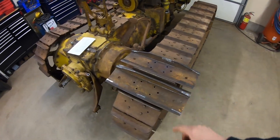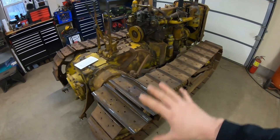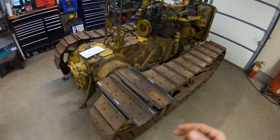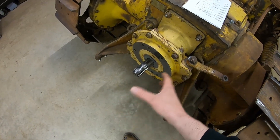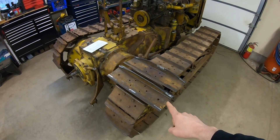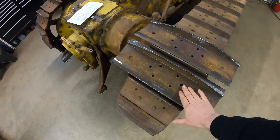The last few talking points center around the super wide track pads I'm going to run on this tractor. A very common comment I've seen is people excited to see this pushing some dirt — not to disappoint anybody, but putting a dozer blade on this tractor has never been part of the plan. This has been a drawbar tractor its whole life and I'm going to keep it that way. That's why we're setting it up to be more of an ag machine — we have the PTO on the back, I'm about to get into the belt pulley angle drive, and we're going to have these wider track pads for field tillage and things like that.